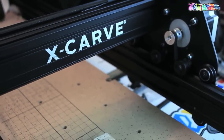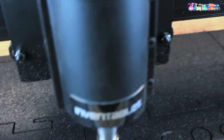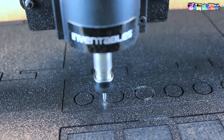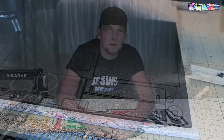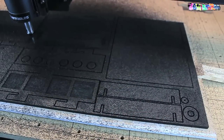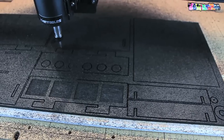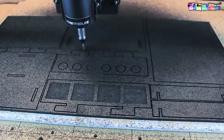You'll see a few shots of me machining the car stand. I decided to machine mine from six-millimeter ABS. ABS is a really nice material to work with — it doesn't give you a whole lot of debris and makes really nicely finished parts, something that looks almost like a factory finish. That's really the look you want to go for if you have a nice-looking RC with nice tool bags and haulers.